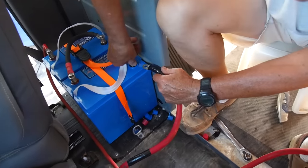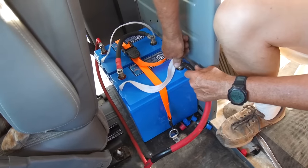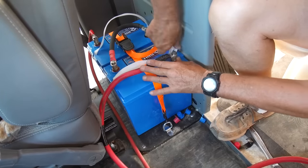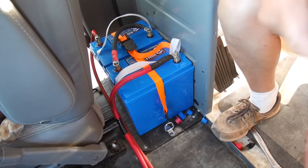Just to repeat so you understand: we have four golf cart batteries. We connected the two on each side in series — positive of one battery to negative of the next — making them a 12-volt battery. Then we paralleled those two 12-volt batteries by connecting positive to positive and negative to negative. Thanks for watching. Subscribe to the channel, like us on YouTube, and live your dreams. Never give up on your dreams — don't settle for a half-life of drudgery. Live your dreams. We'll talk to you later.